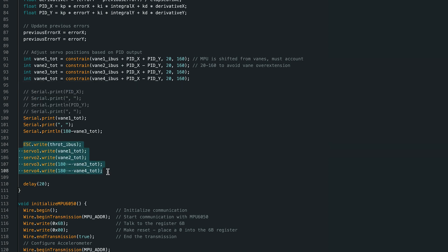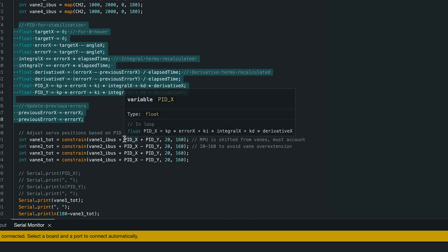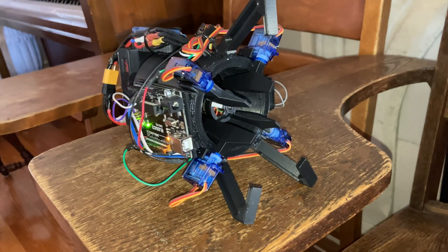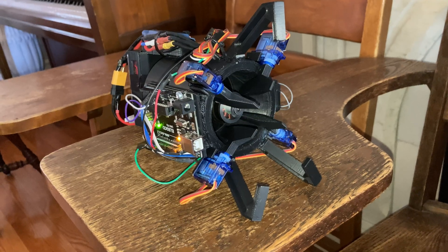This is where the PID comes in, and I tried implementing one, but either my tuning is just way off or I used the PID wrong, because the response I was getting without the PID was a lot better than anything I could tune. I can keep trying and obviously I want to use the PID, but for this iteration I ended up just sending it and using the complementary filter alone. With my very limited knowledge on controls, I'm willing to bet I'm just implementing the PID wrong, but I'm happy that I can get good angles from the MPU and map them to the servos in the fashion I want.